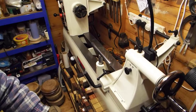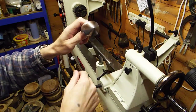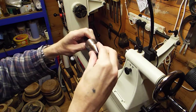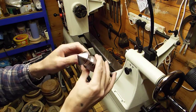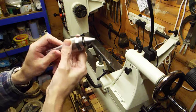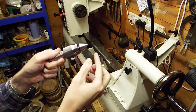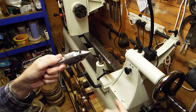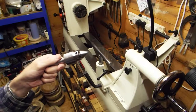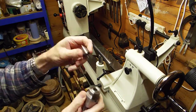The one that I tend to use most is this large cone. With it being a good size, it fits into vase necks and stuff like that - very adaptable with it being a nice large cone. This is the standard cone, a 60-degree cone that comes with it. You can also buy the live center with just this 60-degree center if you want and buy the other ones separately, or they'll sell you a pack that includes them all. I bought the pack that includes them all and it was around 60 or 70 pounds.